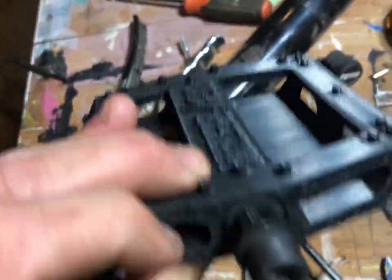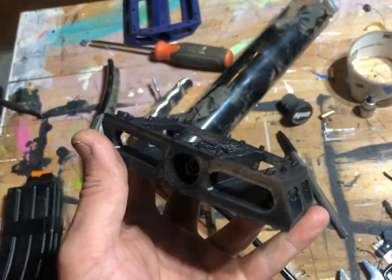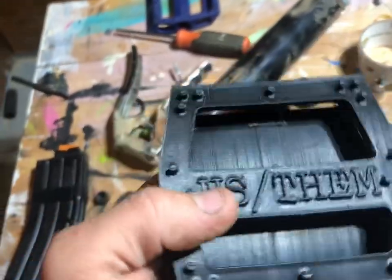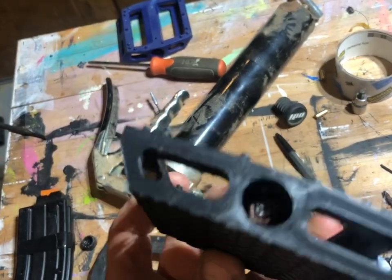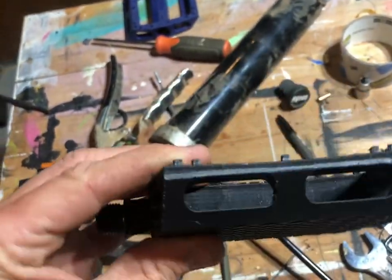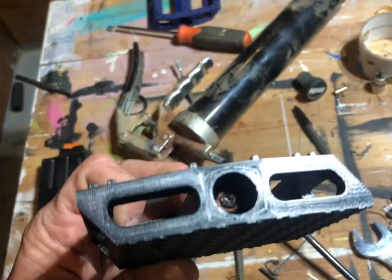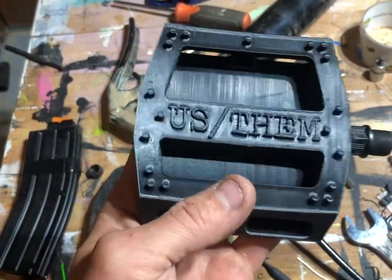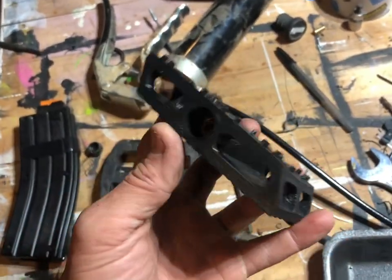Loose ball bearings, everything. Even fit — a little rubber seal on the back. This is version 2. I added the concave better, raised the platform by 1mm. These are also 6mm thick. The bottom is 7.5mm. Diamond plate bottom — this is 10mm thick. I'm gonna go get on the CAD program and make myself a little cap for the end of it. I'll print it out of white PLA. Make it look all pretty. Let's do it.